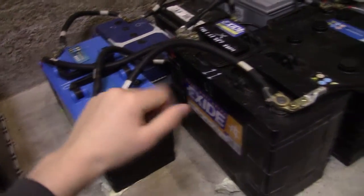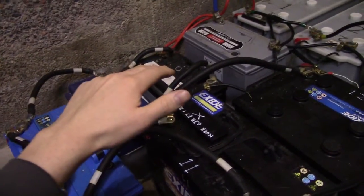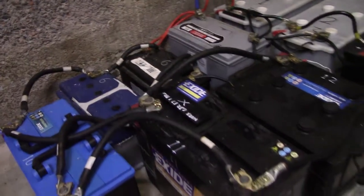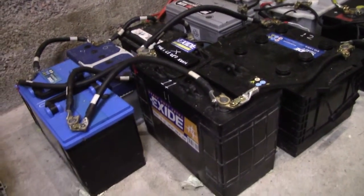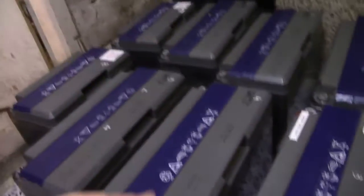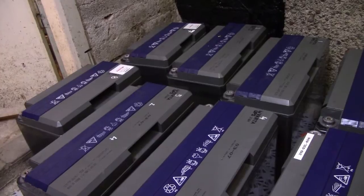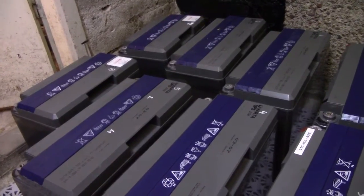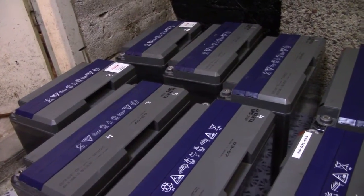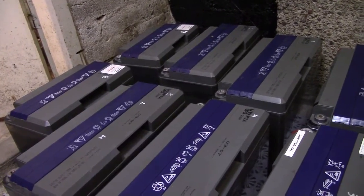I think this one's about 60Ah, this one's about 60Ah, that one's 14Ah, that one's about 20Ah, 17Ah I think—so they're really rather worn out. The worst one of the new telecom batteries has 25Ah in it, which isn't too impressive, however these are going to have far superior cycle performance, so I can expect more reliability over a longer period of time.